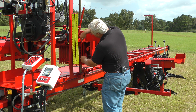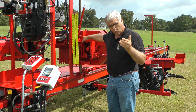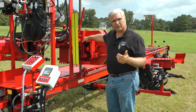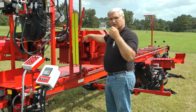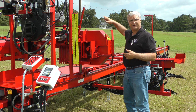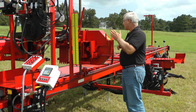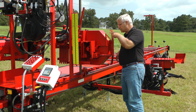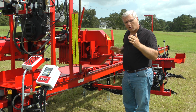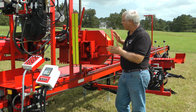If we loosen these and open this up — and when I say open it, we're only talking about a sixteenth of an inch, maybe just a little bit more than that — I would turn about a half turn, then rotate my wheel in the direction of the cut, not the opposite, but in the direction it will be cutting. And I can watch — we'll get a video of this in a minute — and I can see where this is running on my band wheel.